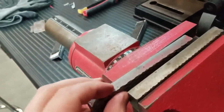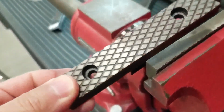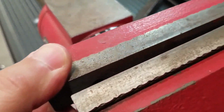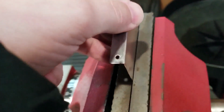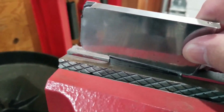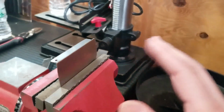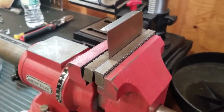These pads, these are metal. They bolt in like that. You have this sharp edge here, this rough edge, and you need a crisp edge in order to bend something straight. So I flip the pads around, and basically I'm going to sandwich the plate in between like this, and I scribe the line. So when you scribe the line, the metal will usually tend to bend at that scribe. So I'll get it lined up, and then I'll hammer it over slowly and gently. Just knock it over a couple times. So we'll see. That's how I've done it in the past.